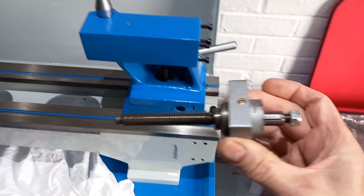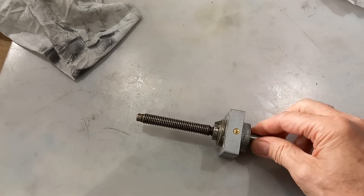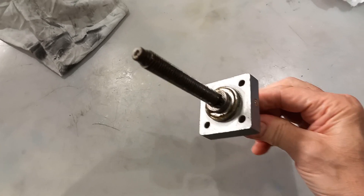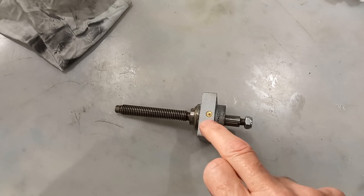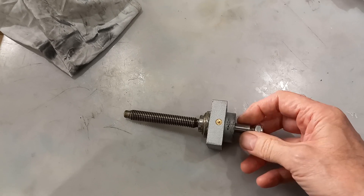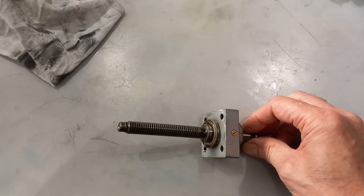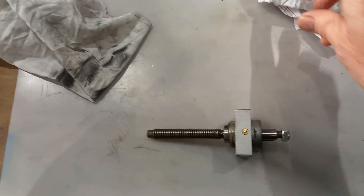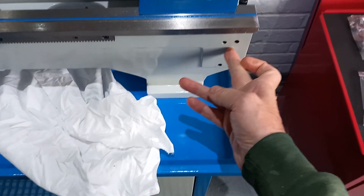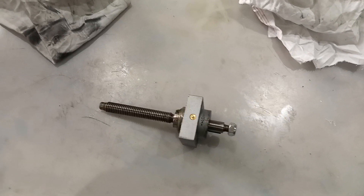This is the small lead screw for the tailstock quill, and I'm guessing it's got a couple of thrust bearings in there. It's clearly got grease in there, but they seem to have thrown in little oilers — I wouldn't expect to put oil in there. It's not exposed; I would pack it with grease and forget about it. It is odd — they stuck these oilers everywhere in the most inappropriate places. At the bearings at the end, there are two sets of thrust races and the oiler is in the centre — the oil is never going to get to the bearings unless you put shed loads in, in which case it will just drip straight out.